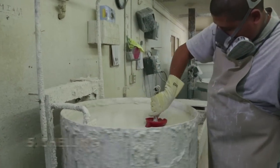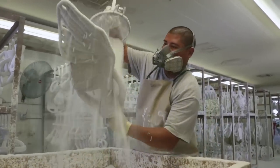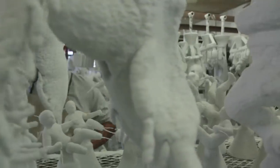We build a ceramic shell around the wax. We do this by dipping the wax into liquid ceramic and then coating it with multiple layers of silica. The shell has to dry for a day or more between each dip, and a shell needs at least 8 dips. So it takes at least 2 full weeks to build up a shell around the wax.